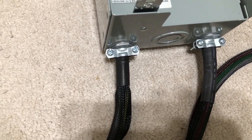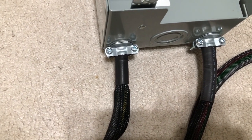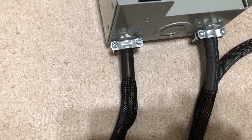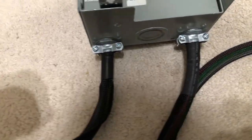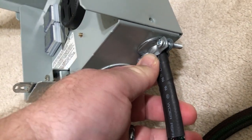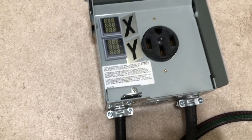You do need heat shrink where the cable goes into the box. There are metal clamps designed for Romex, and I added about two layers of heat shrink there because I wanted strain relief for the cables and to not have them bend too much. It's pretty firm — not going to have too much of a pinch there. Does a real good job for strain relief right there.